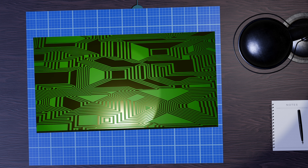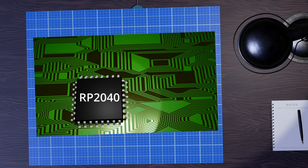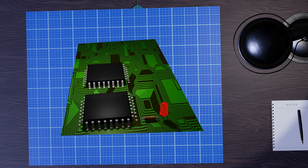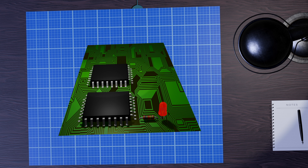On the Pico W, things are a bit different. They had to use that GPIO line to control the Wi-Fi controller, what we call the CYW43. And therefore the LED on board is actually now connected into that Wi-Fi controller, which seems a bit strange, but that's how it's architected. So it is a GPIO line coming off of the CYW43 Wi-Fi controller. That means that in order for us to flash that LED, we have to send a message from our RP2040 over to the CYW43 to ask it to flash that LED by raising and lowering that GPIO line.